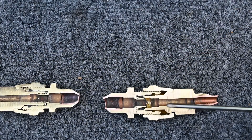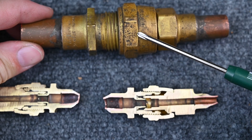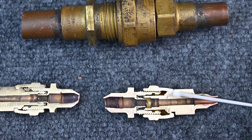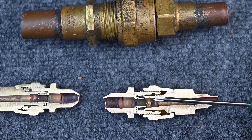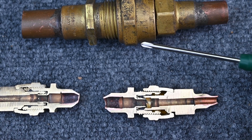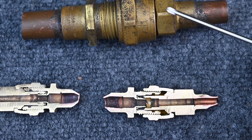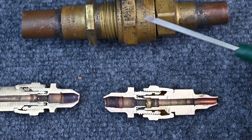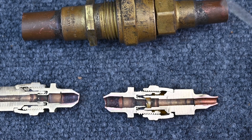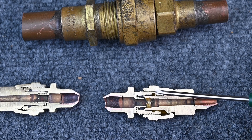Let's take a look at how the liquid line mechanical fitting looks. Here's the cover piece — you can see how it grips on these two edges, keeping this end shoved all the way up inside. There's another spot here to put your wrench. The idea was you put a backup wrench on here when tightening, because if you simply spun this, the whole copper tube would twist on you. So you used a backup wrench, and this connection is what tightened it all together.